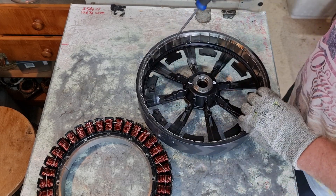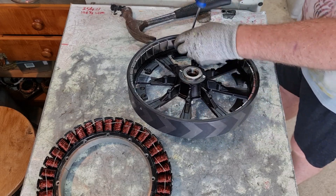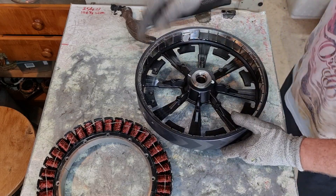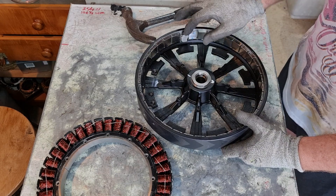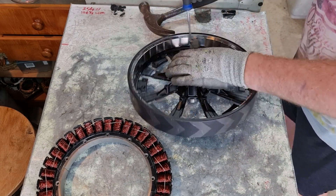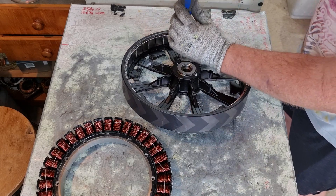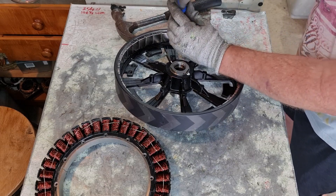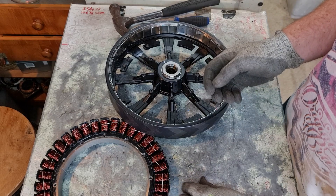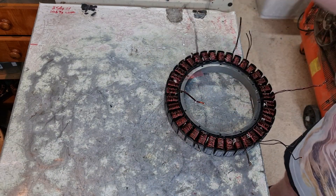What we'll do now — I'll just get a flat blade screwdriver and tap it down the back and peel it off. A little bit of the magnet comes away with it but that's not crucial, and then I do that all the way around. I let them fold onto each other about three or four thick — four thick is probably too powerful — and slide them up all the way around. I've cleaned all the loose bits off and these are now really powerful magnets. I've also cleaned all the insulating material off the stator and lifted it all up to make it easier to unwind.